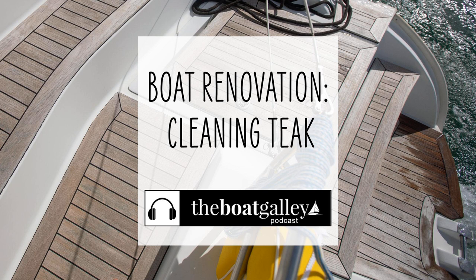My technique for cleaning the teak is a little different from the company's instructions, simply because my teak was so filthy. They say to spray the teak cleaner on; I used a foam brush to soak the teak with it. And since I was working inside on much of it, I couldn't run a hose over it to rinse — I had to use rags and wipe it off. It's important to note that cleaned teak should have the first coat of finish put on it within 24 hours of cleaning; otherwise the natural oils in the teak will rise to the surface and the finish won't adhere as well. Plus, the mold can start to regrow. You can apply the finish as soon as the teak is dry, but I always did it the next day. So don't clean more teak than you can apply finish to the next day, and if you're working outside, watch those weather reports.